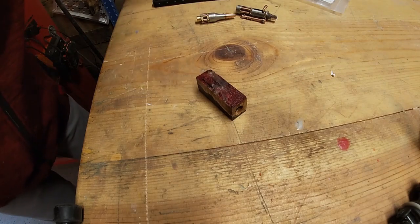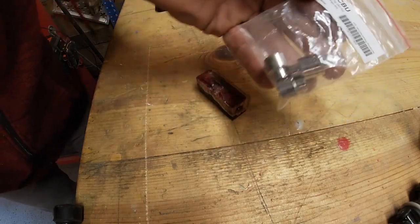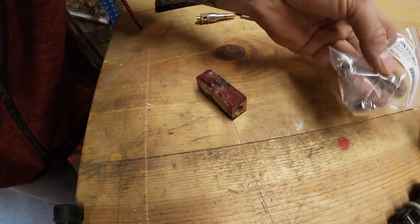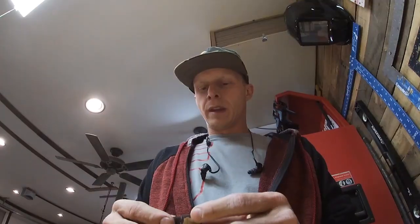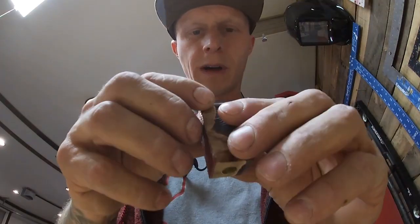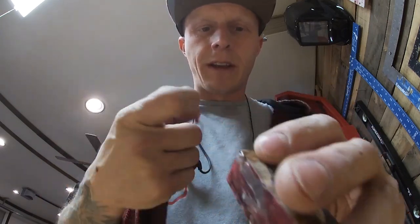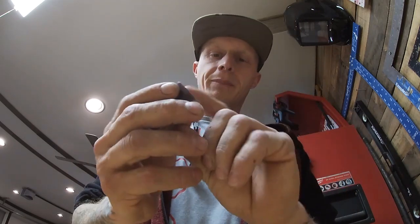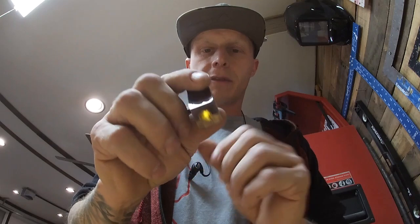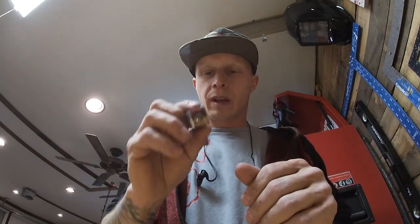Then we're going to put it on the heater and let it cure for an hour or two — the longer the better, but I don't have patience for that. So I'll put it in the heater and come back, get it on the lathe. I've got the right bushings here for the Victorian pen kit — just need the end ones and not the middle one since it's a one-part pen. This has been drying for a while now and I've got it sanded down. I don't have a 3A's pen reamer so I just use my bench top sander with the 90-degree fence. A reamer definitely works better, but I don't have every size.